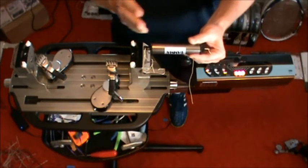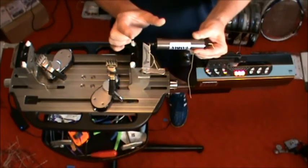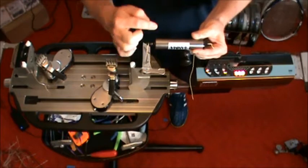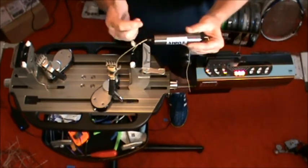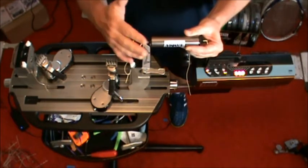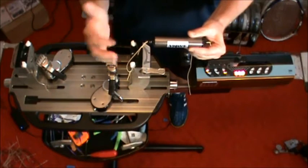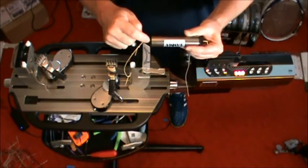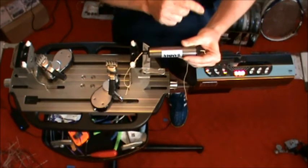If you wait a number of seconds, or 20 seconds, 30 seconds, this is going to be going down slowly. The white line that you could see in that brief moment when you achieved lockout, you may not be able to see that line if you are looking at this 5, 10, 15, 20 seconds after the fact. So you want to be staring at this when you're calibrating a lockout machine right when you achieve lockout.